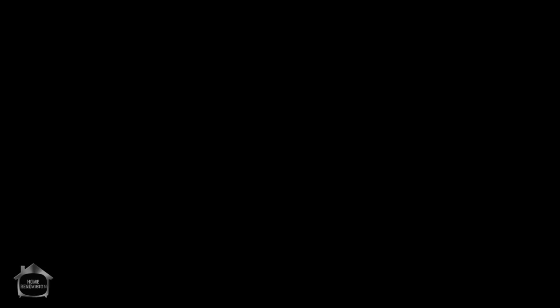The next paint we're going to talk about is semi-gloss — this is basically the trim paint of choice. There's also a high gloss paint on the market. We're dealing with new additives to create more and more shiny effect — that pop on the windows, doors, and trim is what you're looking for. If you have really ugly walls and want a painter's secret, you can use matte paint — it doesn't have as much light reflecting off it, it absorbs it, giving you the ability to hide a lot of imperfections. In stairwells and similar areas, using a matte paint can really hide imperfections so you don't have to get up on a ladder to do touch-ups and repairs.